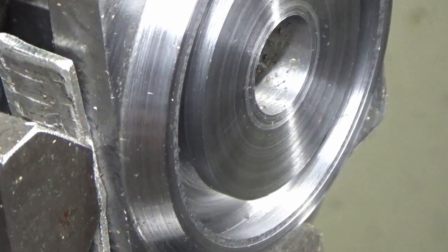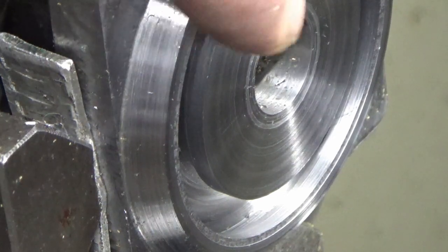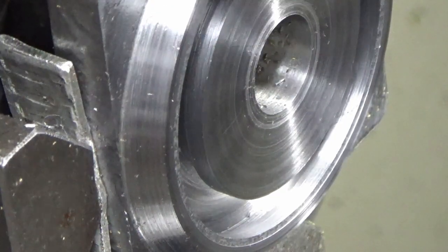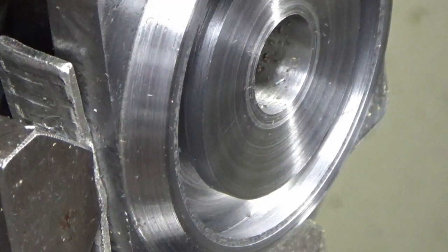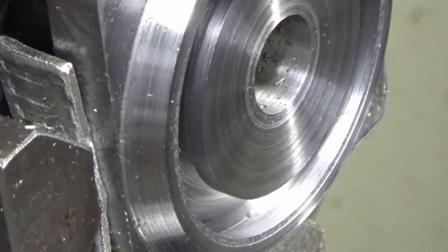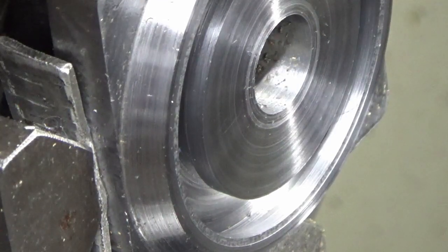Alright then guys, happy days. That tool cut absolutely fantastic. The only issue I had really was swarf clearance is a bit of a nightmare, and that's largely because I've got everything so tight up there's not a lot of room for the swarf to go. So a couple of stops as we go along just to clear the swarf, and nice and steady, 260 rpm, and it cut sweet as a nut, to be honest. I'm really pleased with that. So it's only got to do that another twice and survive, and that's all three done.